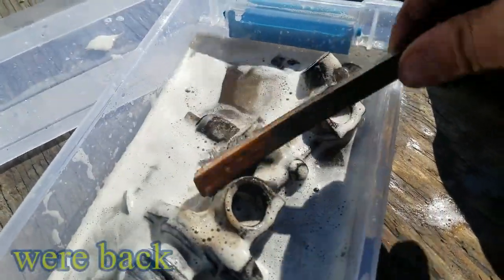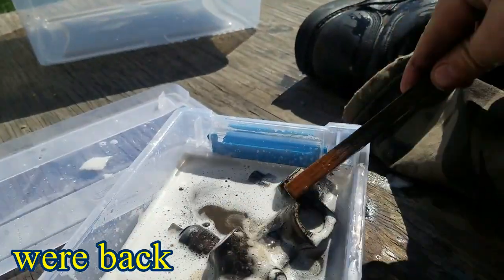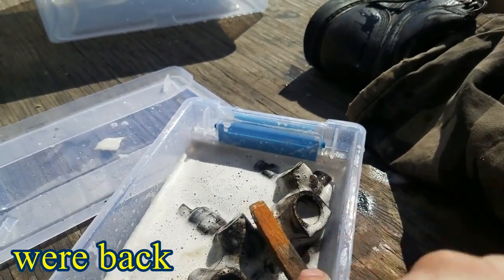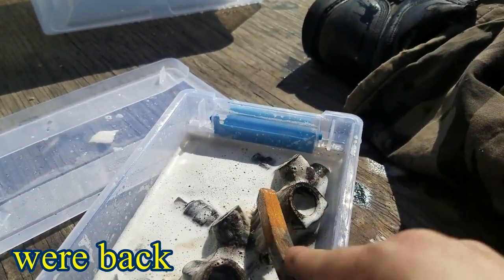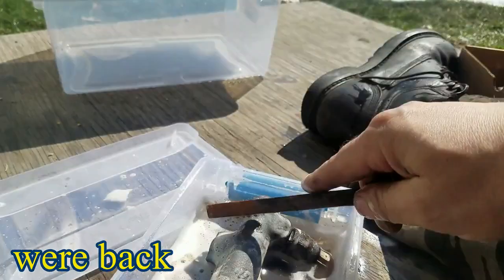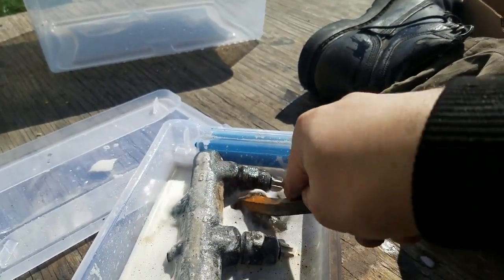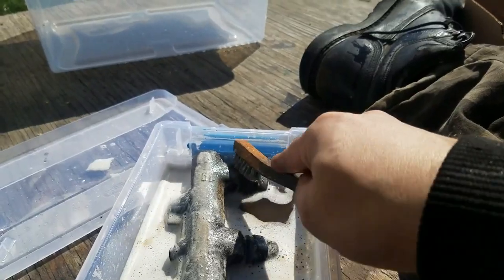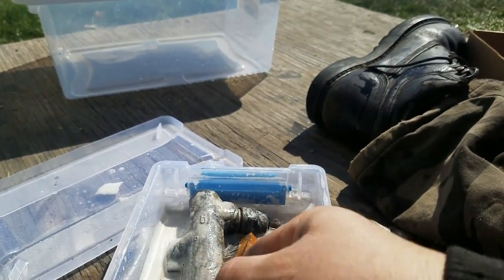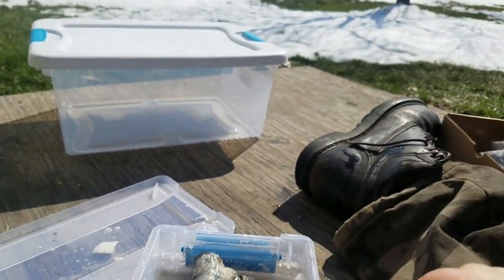The neat thing is when you brush it, the rust comes off without a lot of effort — it's nice and gentle. You do one side, then the other. The other side was easier to clean because it's flatter. I think this stuff really works well. I've done it on some other parts with this restoration. After I'm done I clean it with some acetone and paint it with a good oil-based tractor-store rust-preventative paint, and it looks like it's holding up pretty well.